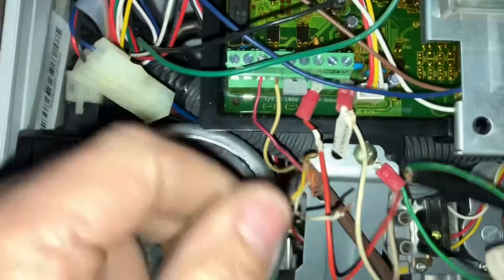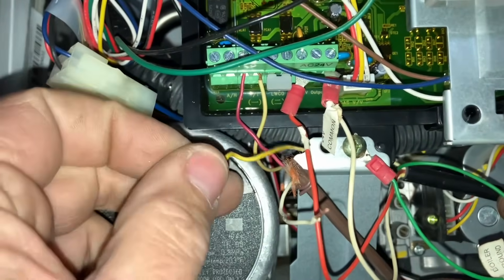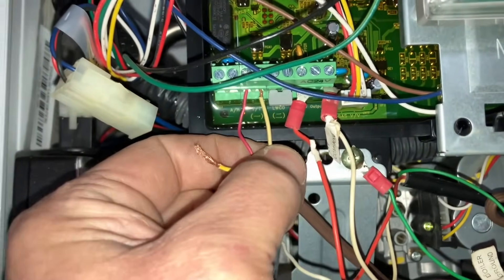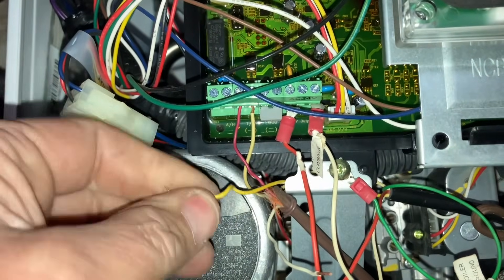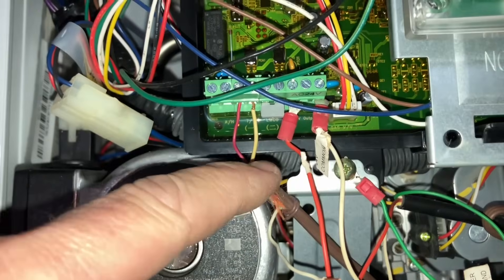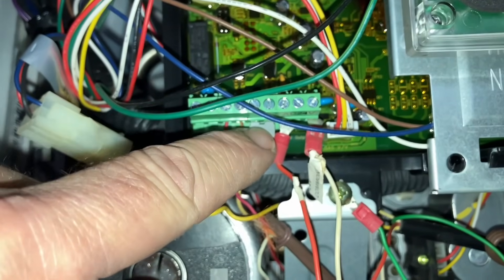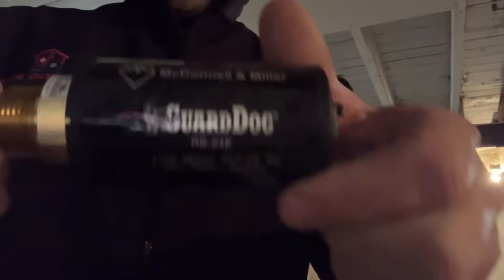How this should have been wired before: the yellow wires coming from our low water cutoff should be going to our low water cutoff connection on the boiler. But here they just broke TT, which is our thermostat — so we can keep it that way, it's fine. But it would be more of a guide to a less experienced technician if it was wired to the low water cutoff connections there, because then the system would give a low water cutoff issue in the event of no heat.